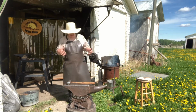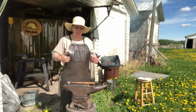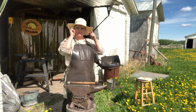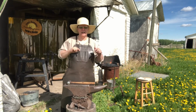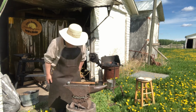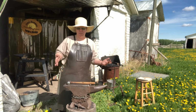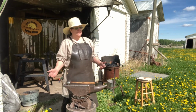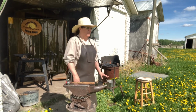And also safety. So I am wearing 100% cotton. I have my lovely apron to keep the heat away from me. Also, so I don't burn myself. Shade. Safety glasses. I'm all for accuracy until it gets to the point where you lose an eye. Let's not get that accurate. No 9-finger blacksmith, please. Definitely stay away from polyester and non-natural products. Linen, cotton, leather, fine. Covered toes. I've seen blacksmiths in those too. That's your preference, but I really don't like doing the dance when I'm burning my toes.